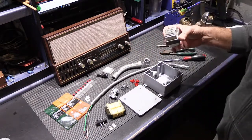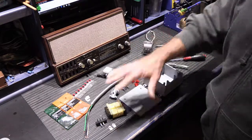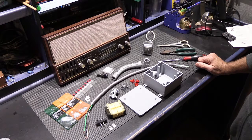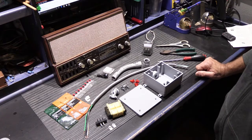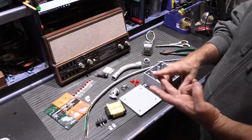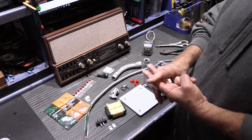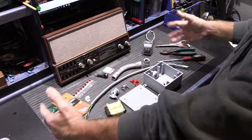Part of my responsibility for the repair of her 2540 is to come up with a suitable replacement transformer, and that's what this is all about. I have constructed transformers for customers before, though I don't think I've ever done one for a 2540. The goal is to create a transformer with the right voltage and wattage, that can be installed safely with no exposed electrical connections, and can be permanently attached to a wall or ceiling.